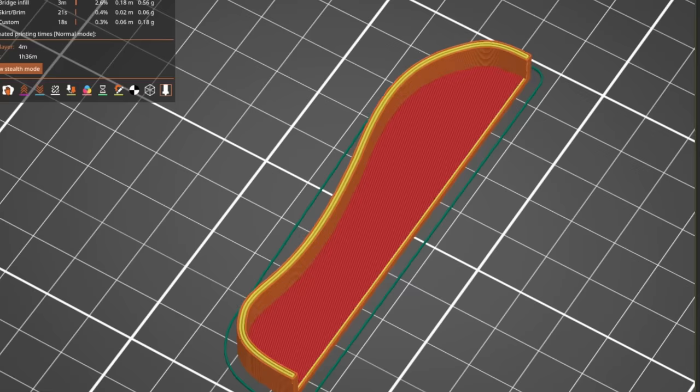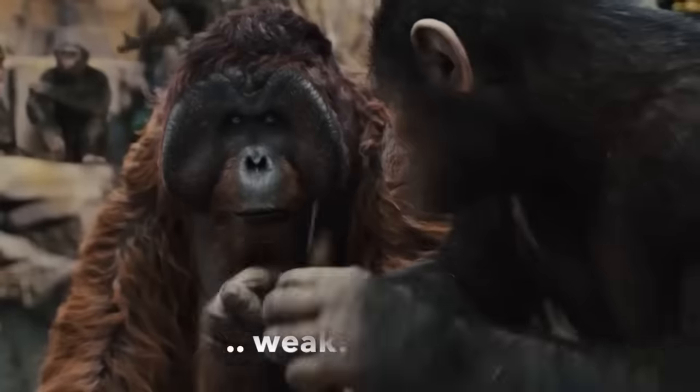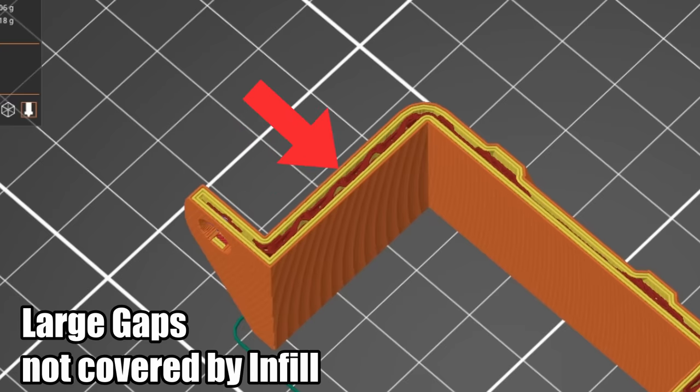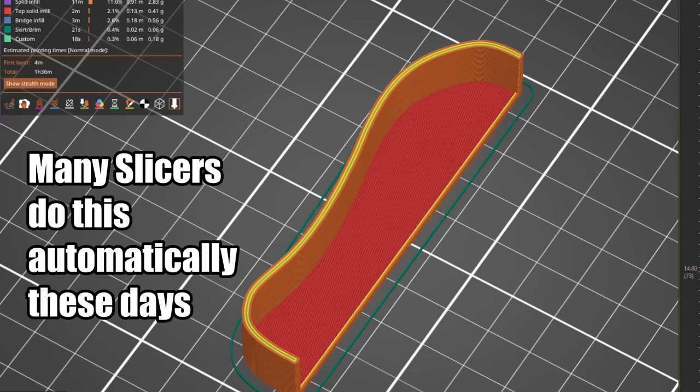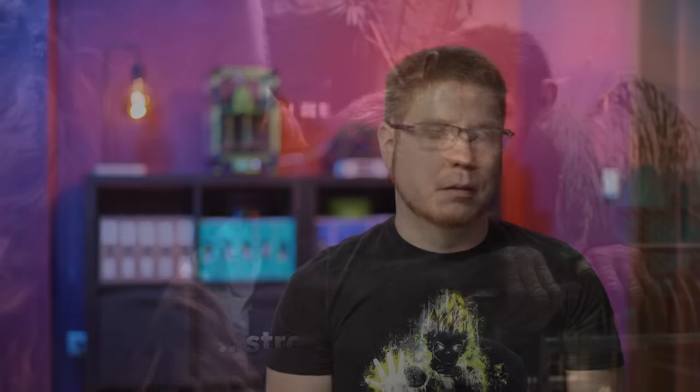For optimal results, a narrow wall should not have any gaps in between the two sides. Having gaps means you get less impact resistance for both walls since they can't reinforce each other. Infill doesn't really help in this situation unless you turn it up to something over 50%, which is seldom a sensible approach. To mitigate that, we need to turn up the perimeter count, but that leads to a lot of wasted material. So please don't overdo wall thicknesses. My go-to wall thickness is usually 2mm, which coincidentally is exactly 4 perimeters on a standard 0.4mm nozzle. It also neatly matches two inner perimeters of 0.6mm and two 0.4mm outer perimeters. Parts designed that way are strong enough for a lot of applications, and in many cases even that is still over-engineered, but it's better to be safe than sorry.